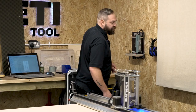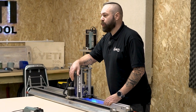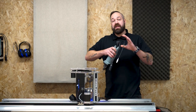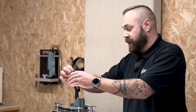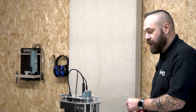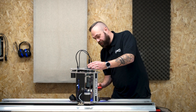Let's go over to the machine where I've got the files loaded and we can start cutting. Now we have our stock loaded and secured down to the spoil board. I'm going to load the spindle and set my X, Y, and Z datums — the file is already loaded to the console, so we're ready to press go. For this project we're going to be using a two-flute 5 millimeter compression bit supplied by Rennie Tools. The bottom part is an up-cut and the top part is a down-cut, which should give us a nice quality finish on both the top and bottom of our project.